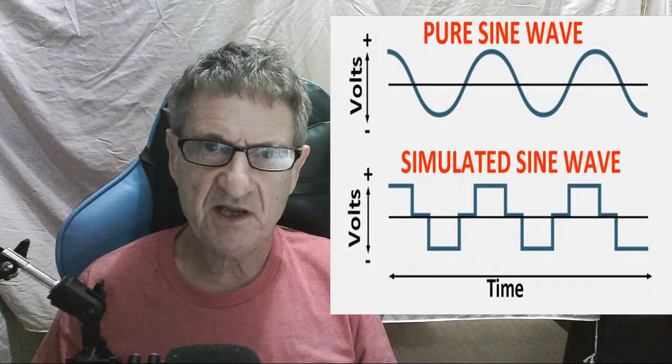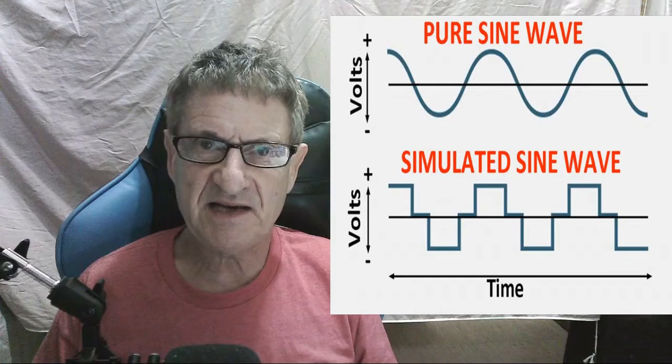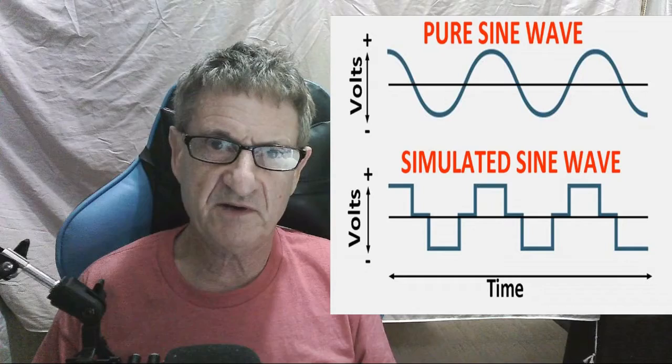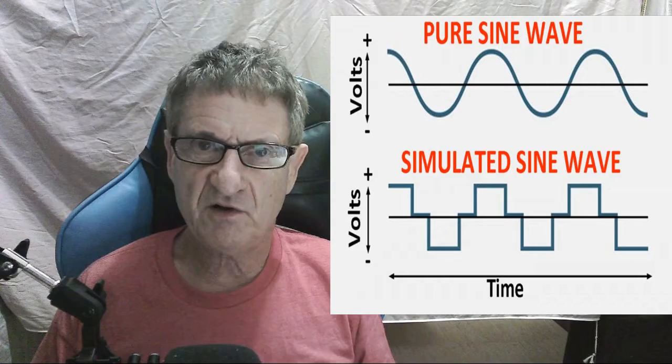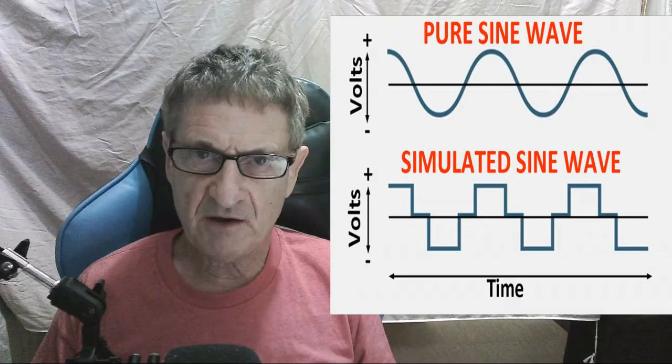Okay, so the next thing I want to talk about is pure sine wave versus simulated sine wave. When you talk about AC electricity as opposed to DC, which comes from a battery, with AC electricity the voltage goes up to some amount more than the rated voltage, then goes back down, and up and down, in a perfect wave. If you were to look on an oscilloscope at what AC current looks like, it looks like this, and that's called a sine wave. And the current that comes from your outlet is a pure sine wave.